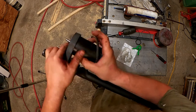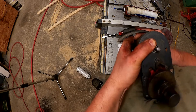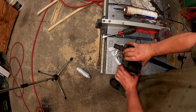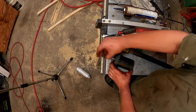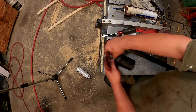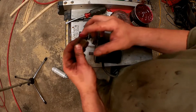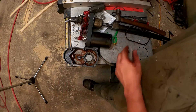We'll just slip that together, then press the bearing into its spot. You can see the shaft spins freely now with everything all lined up with the new bearings. Now we've got the gear on the motor — you might need a gentle tap keeping that in place. Tap-a-tap-a-tap. Re-grease everything here. I still have the gasket to the gearbox so I will use that but with a little bit of sealant.